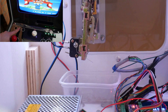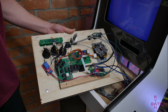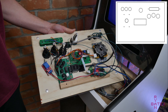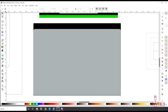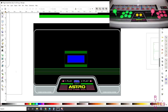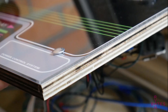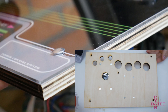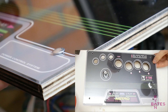The wood part of the control panel was cut from quarter-inch wood on a laser cutter, drawn up in Inkscape since it has many specific holes. The control panel artwork was also drawn by me in Inkscape by recreating reference photos. The final panel is a sandwich of the wood base, graphics printed on glossy photo paper, and a clear acrylic laser-cut top, all held together through the arcade buttons and binding posts in the corners to keep the acrylic from lifting.